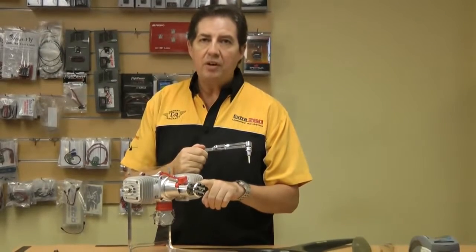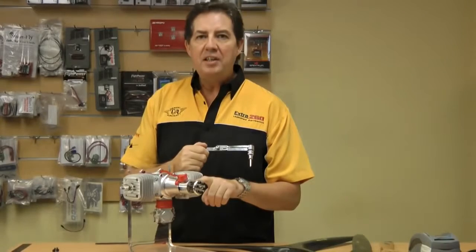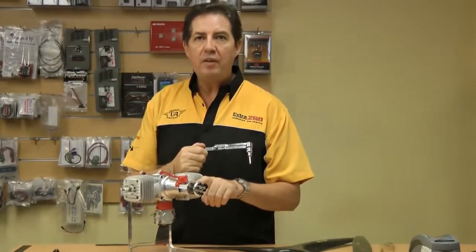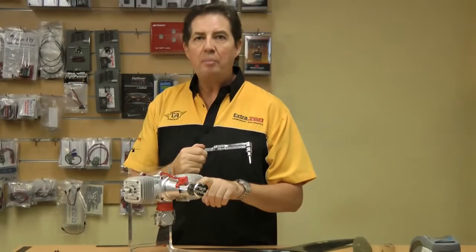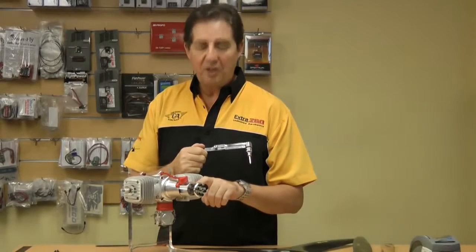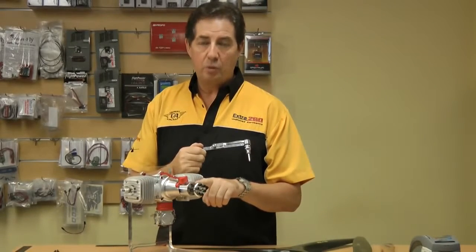Quite a few times I decided I didn't need to check it because my carbon prop didn't feel like it needed any tension, and soon enough I lost $500 worth of propeller and spinner off the front of my aeroplane. Now, I've never had a loose prop bolt since. I've decided I should check them every flight. So it's good policy to check your prop bolts quite regularly.